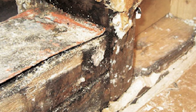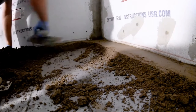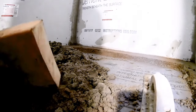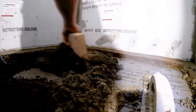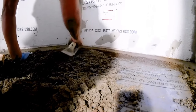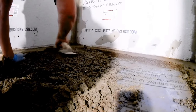I don't blame anyone for being nervous about putting the backer board in the mortar, and I don't think there's anything wrong with leaving a small gap — the only negative is that it's going to be more difficult. If you choose to leave a gap, just make sure you have the liner supported so you can properly pack the mortar at the edges. And if you're using a metal trowel, be really careful not to puncture the liner when working the mortar.